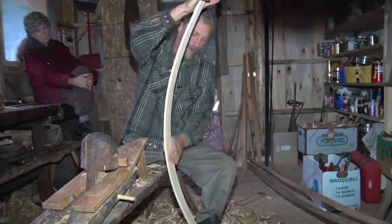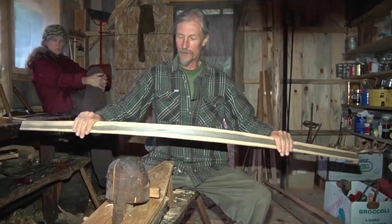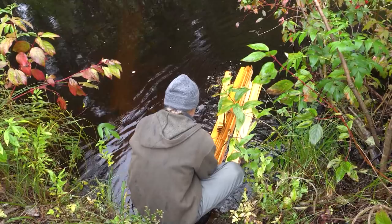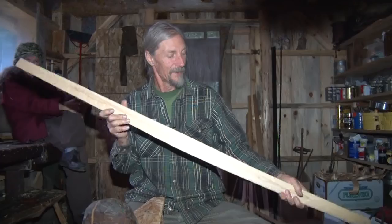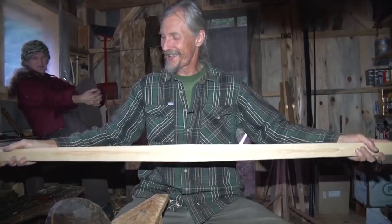Here's the test — if it feels like a big piece of spring steel, then when I give it the hot water treatment it'll be marked for the width of the bottom of the canoe where it's going to go. When done, take all 50 ribs in a big bundle and throw it in the river. One year the river had a big rain and washed all my ribs away — I had to spend the next day in the canoe going downstream finding all the ribs. That was really nice — had a day off and caught some fish too.